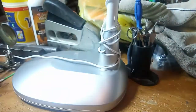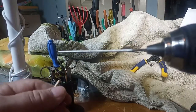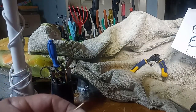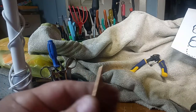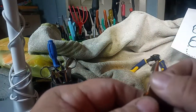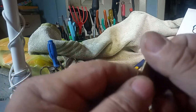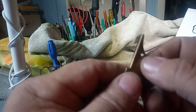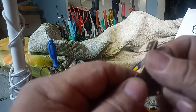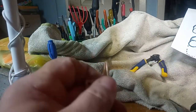You could also put your reamers in your cordless drill — it'll go a little bit faster. Once you get to the point where you think you've got the hole the right size, you grab your bushing and try to put it in. Because you're doing this, you're going to create little burrs on the material. So you either take a file and file it off, or the proper way is to take a chamfering tool — which I don't have. I'm going to put the bushing in, so stand by.